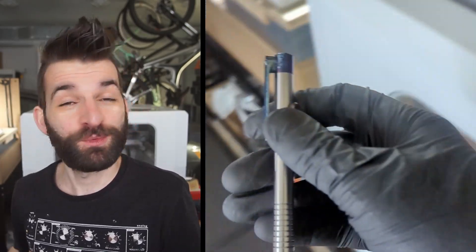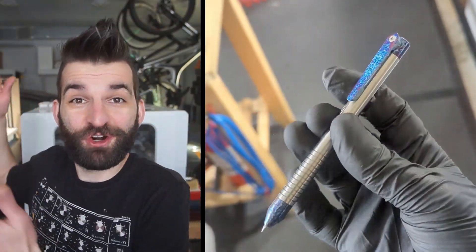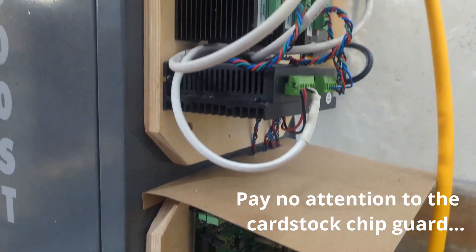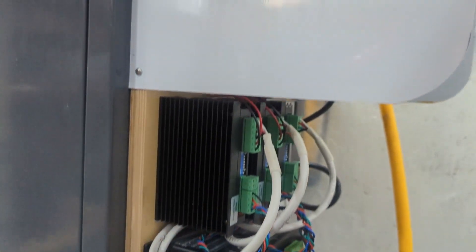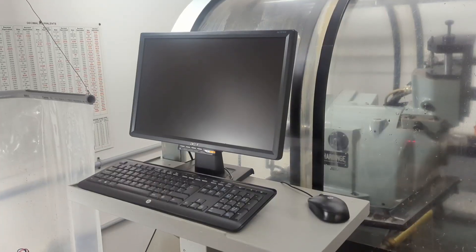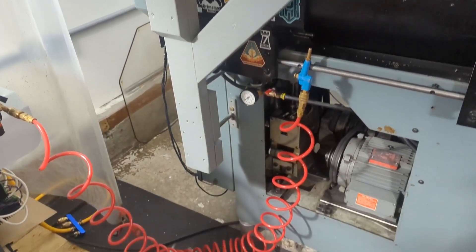I'm very excited to start working on the next batch. Since then I've also converted my mill over to run on the Mesa card — just a two-second boot up, who doesn't like that? All machines are now linked via network, so when I want to drop code on any one of them I can just drag code onto them, which is super useful. In the past I was using a USB stick, which gets tedious. Being able to live-drop code is a big win.